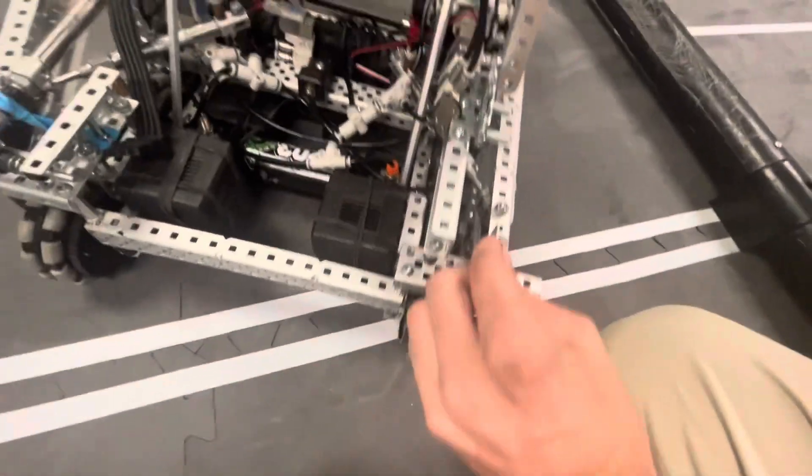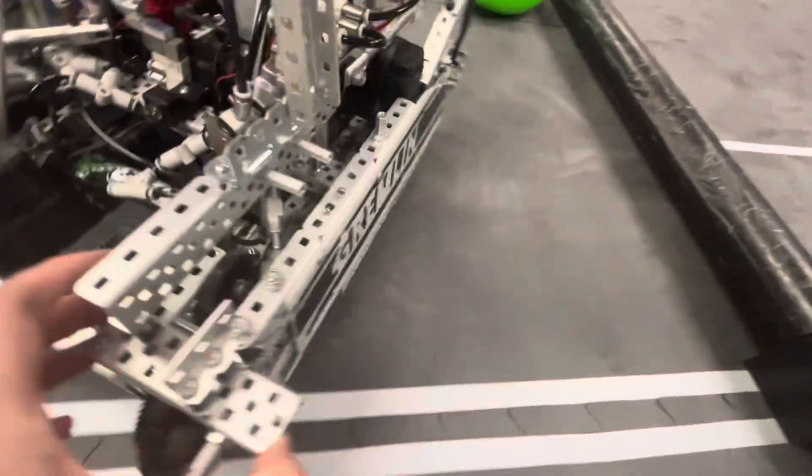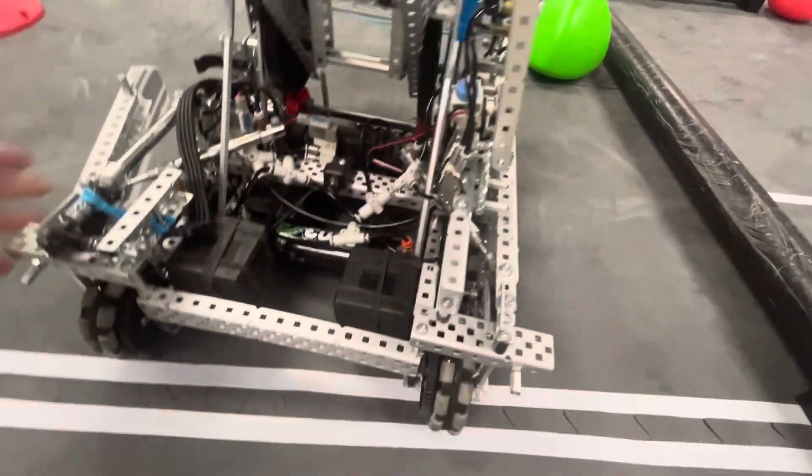We do have a three-wheel drive gap, which means we did have to shave off some of the gears inside. But for the most part, it's pretty frictionless. Everything runs at about one watt, which is pretty good — plenty good enough for our drivetrain.